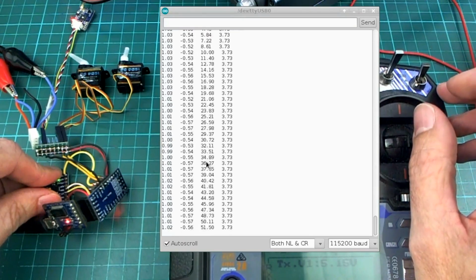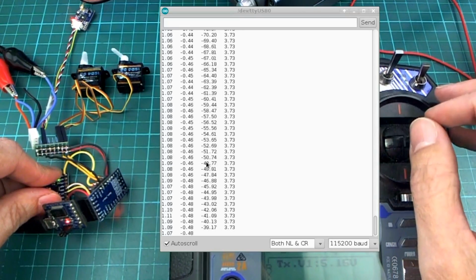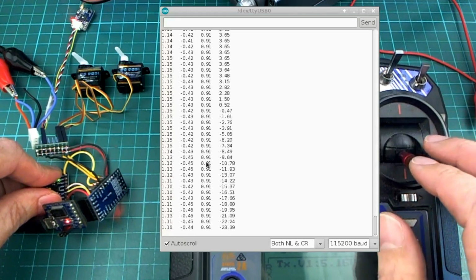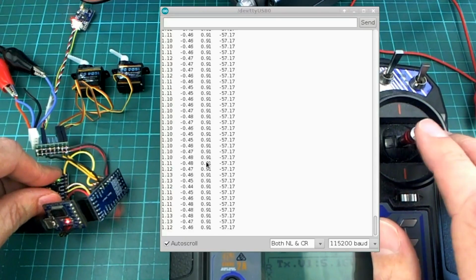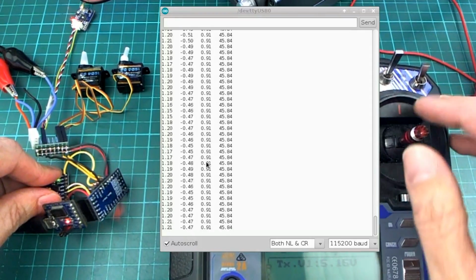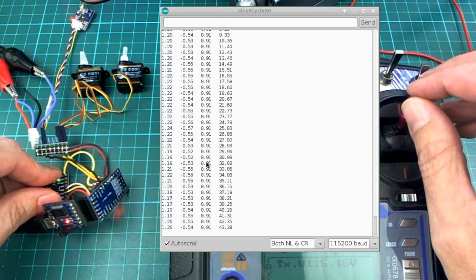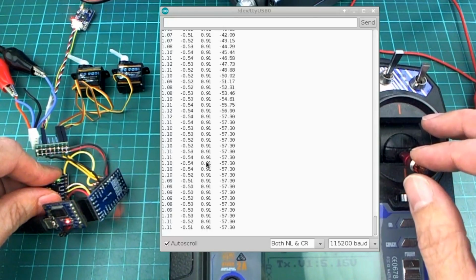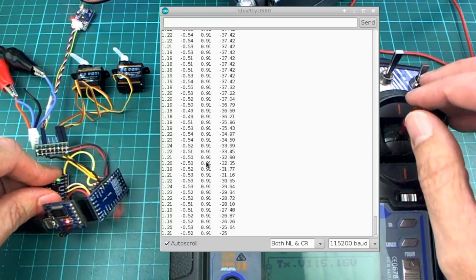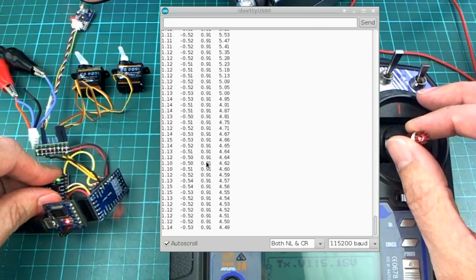It takes about that long to go from positive 75 degrees to negative 75 degrees. So it's a little bit on the slow side perhaps. It might feel strange to fly compared to what I'm used to. And pitch limits are to about, so this should be pitching up at 60 degrees and pitching down at 45 degrees. Actually, I might have got those the wrong way around. But anyway, I think that the pitch angle limits should be a little bit less aggressive than roll. We'll see. Anyway, it should work out. So I can get that back to have enough precision that I can put it on 0 if I'm careful.